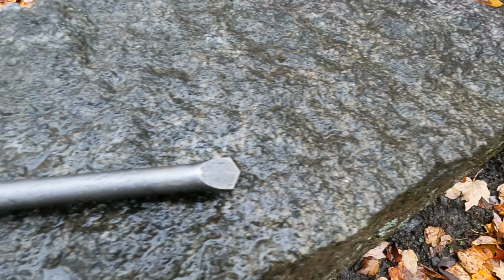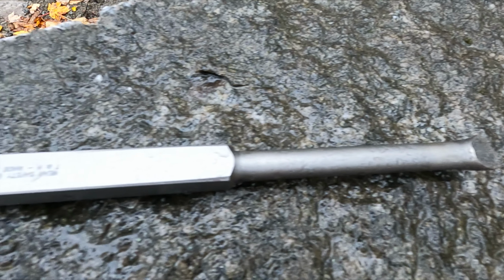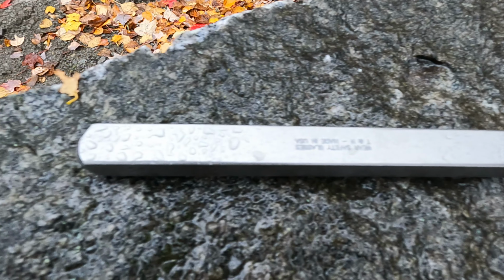I've gotten a lot of questions about how they drilled holes in granite before electricity. Well, I think there's a transition period where they're using steam or compressed air with rock drills, which are big, massive roto hammers, basically. But before that development, they used hand drills, and it's just a chisel that's designed to drill a hole. It has a cutting edge that's a bit wider than the body of the tool, so that the shank doesn't get bound up inside the hole, and it provides clearance for dust.